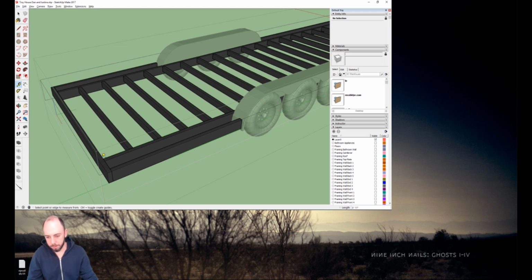I have to go back out there and do a quick measurement, because I wonder if, so this was 15 inches, then is this 16? It is 16, and then is this 16? It is 16. Okay, let me go outside and remeasure to make sure that that truly was 48 on center, or if something I've done here is messed up. So I'm going to go confirm that. I'll be right back.